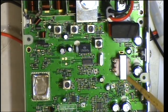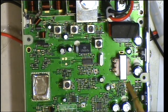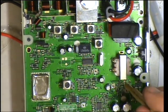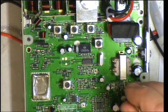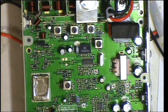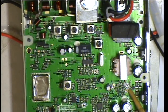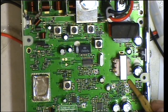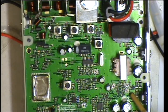The first preset for power is W3, next to what I expect to be the modulation transformer. We'll just set that — it easily does 4 watts. The control below is W6. When you're in Germany and AM is 1 watt, that is the power setting for low power. So W3 is the normal power setting for FM 4 watts when we're in the UK, and W6 is the low power setting it selects automatically in AM mode for Germany.